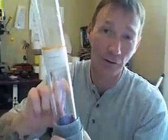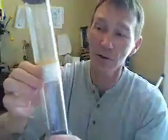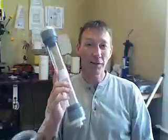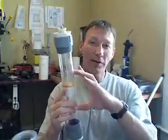One thing I wanted to point out is if you see that brown little liquid in there, in the top of this I put a stainless steel scouring pad, and obviously it's not that stainless, or it rusted and corroded, and that's what that brown fluid is. And I only noticed this because some of this had seeped into this lower section or chamber of the bubbler, so that's why I know that not all check valves are the same. So I'm going to go with a little bit more expensive check valve, a ball check valve from McMaster-Carr, but I think it's going to be worth the expense to really truly separate these two.